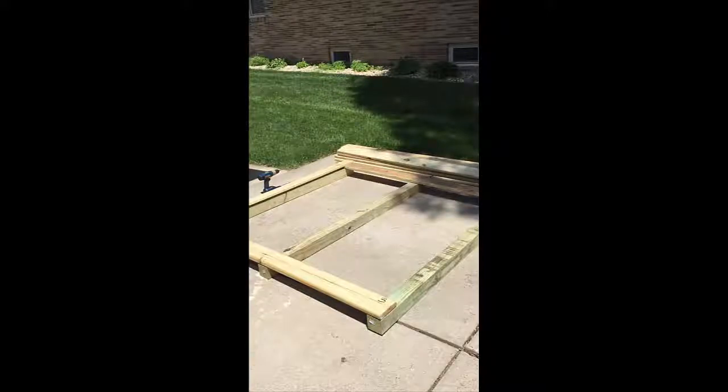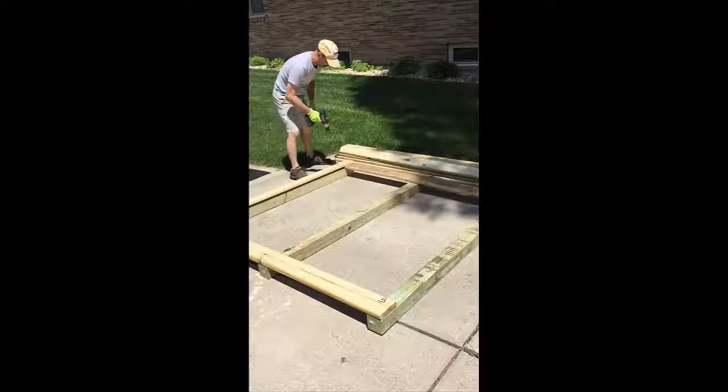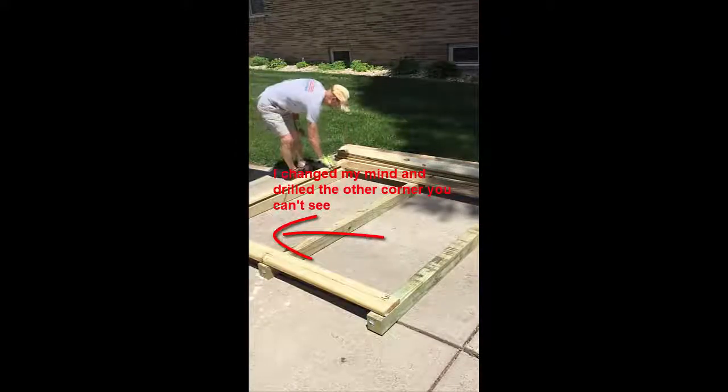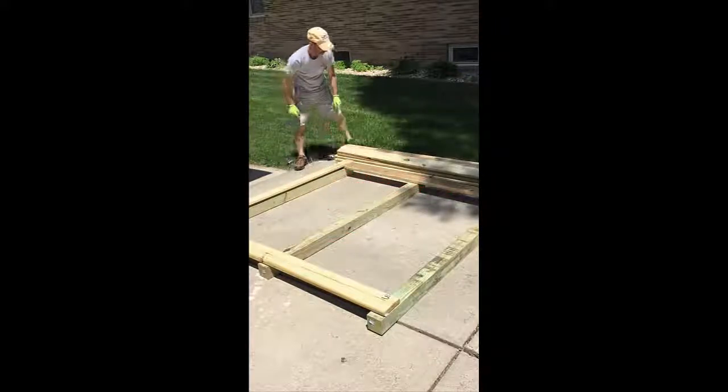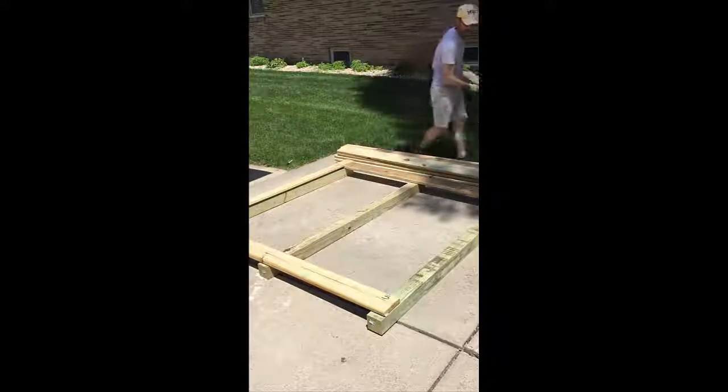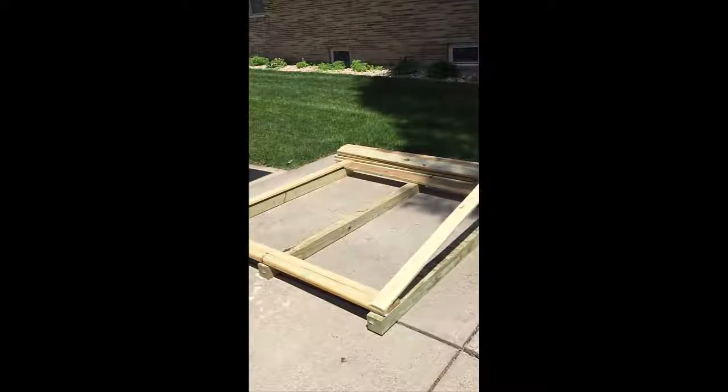The next step is to drill a 3/8 inch hole for my bolts through the 1x4, the deck board, and into the base. I'm drilling on concrete, so I'm not going all the way through the 4x4. For now, I only need the hole deep enough to keep all the pieces at the end of the stage together. And I'm only drilling one end of the stage because I'm not sure how the deck boards will fit.